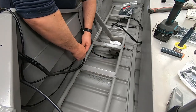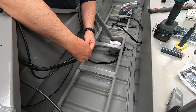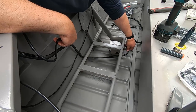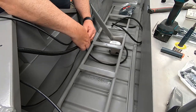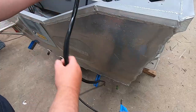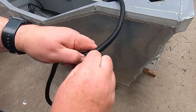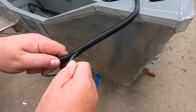A bit fiddly to use, but I've got all our joins in there. So nearly there — all the joins hidden away and now we're back to raw cable. I'll slide this down a little bit further to the end and put some tape on that end. So here we've got the cable for the bilge pump already in this split conduit and I'm feeding the charge wire from the outboard in the same conduit. Once we get that in there we can thread it through the gunnel up to the control panel, nice and neat.